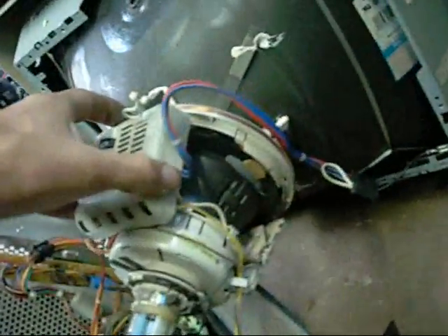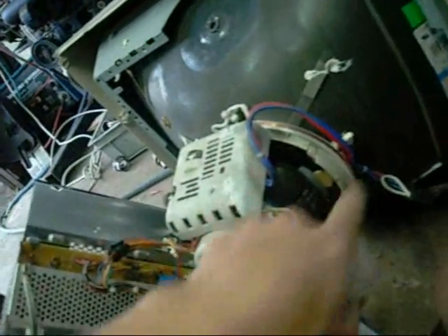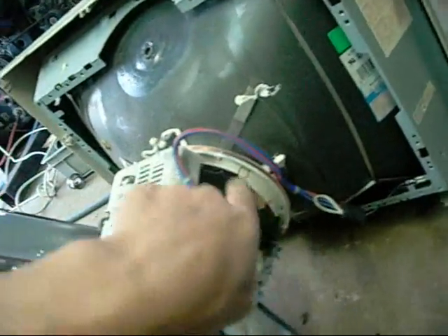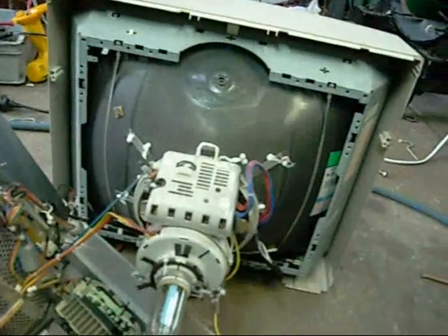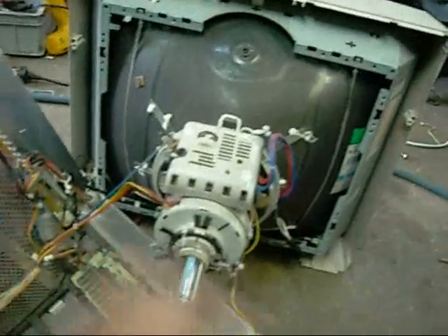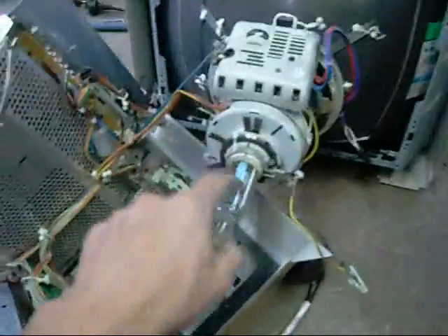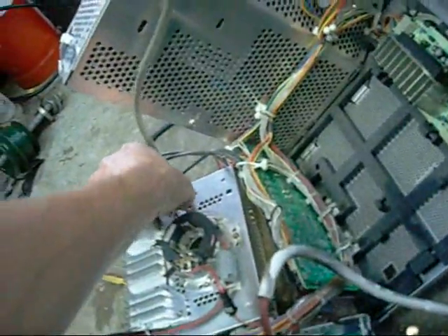The yoke is rather complicated as well. There are some field coils out here, coils inside there, a coil around the outside which I've seen on regular monitors, and then the regular coils underneath. It's like an X and Y axis — horizontal scan and vertical scan — which arranges the beam scan coming off the gun in a certain pattern to create your image. It's been ages since I've studied exactly how a CRT works.